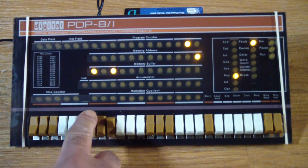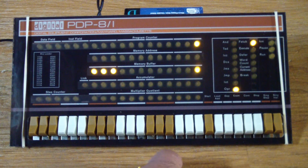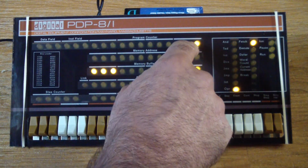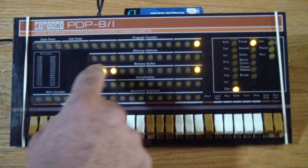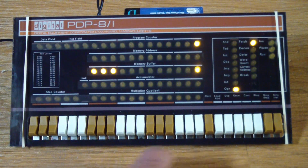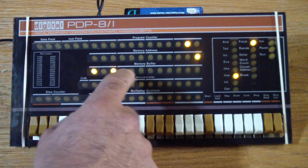First thing we should probably do is make sure that we entered this stuff correctly. So we do a load address again, go to program counter 0, and press the examine button. And it tells us that at location 0, this one's the actual program counter, which has already gone to 1. But this is what we're actually looking at. Memory address 0, 7001. That's correct. And then we can examine our last instruction, which was the jump instruction, which is 5000.